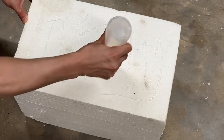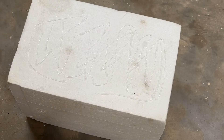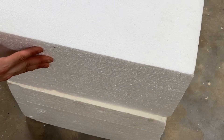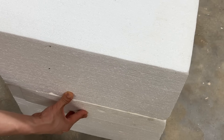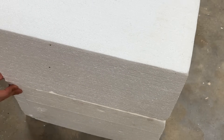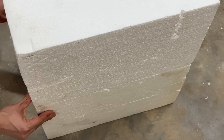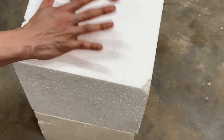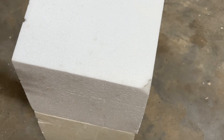We're going to pump heavy amounts of glue just like that, and I just like to go back a little bit like this. Then grab your second cube and gently place it on top, and just ever so slightly shake it a little bit back and forth — nothing too crazy. Then quickly level it to make sure all the sides are flat. Once you're done with that, put something heavy on top and don't touch it for 12 hours for it to fully cure. I normally leave these overnight so they can fully cure.